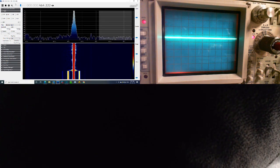Wait a second, I have to turn off this, which is maybe easier on our ears. We don't have the sidebands now, but I know where the control is. The control was set about here. That's 5 times 100. 500 microvolts is causing that. That's the limit, so to speak. 500 microvolts.